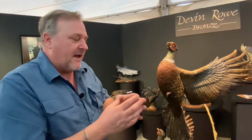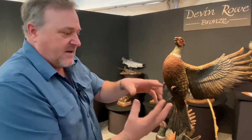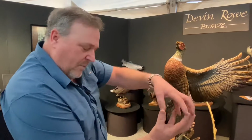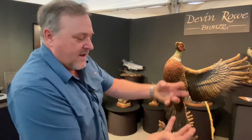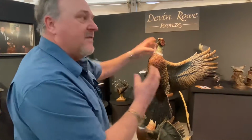Okay. So it's kind of like a caulking. Yes, like a rubber. And then the back of that is a ceramic base or fiberglass that keeps the rigidity. Once the rubber is hard and the plaster on the back, we cut it and pull it apart. And then inside this, there's that clay, and that's just basically thrown away. So now if you look inside this rubber, there's a head of a pheasant. Maybe grab the other mold and there's a wing.